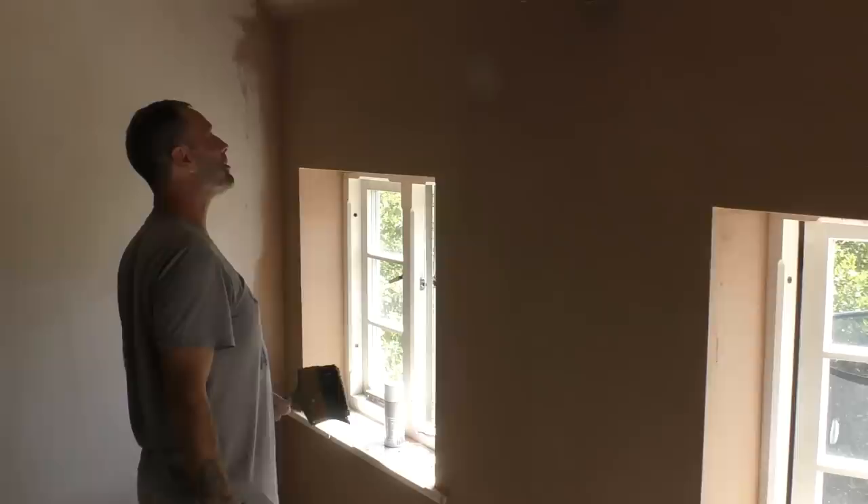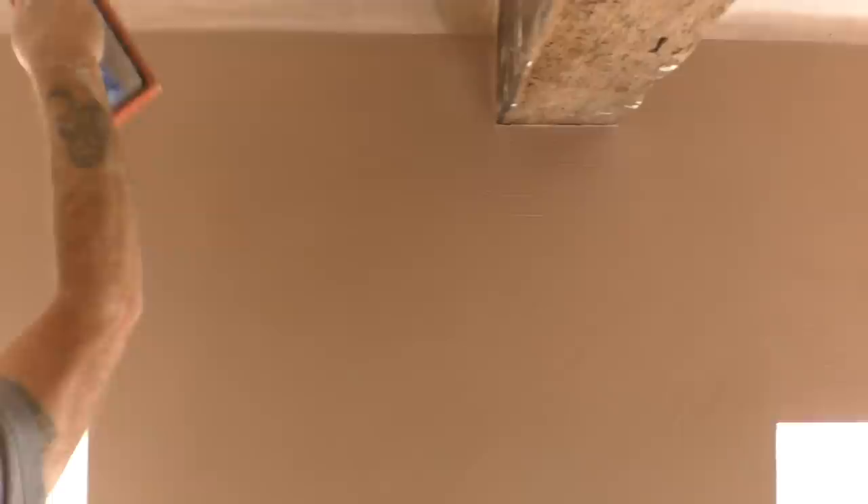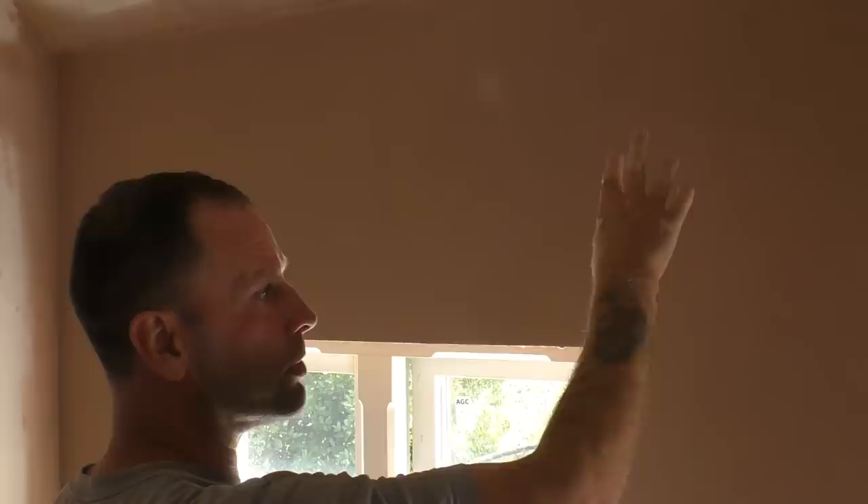How long are we going to let that go off for now? I'll probably let it go off about a quarter of an hour, then give it the final trowel — I'll cross-trowel it. We'll show that in a minute. Most important thing: keeping lubricated. So you're constantly using a paintbrush with water to straighten the liner — is that to stop it going off? Yeah, and to get the fat back up as well. If it sucks in and starts drying before it's gone off properly, you put a bit of water and it brings it back up to the right stage.